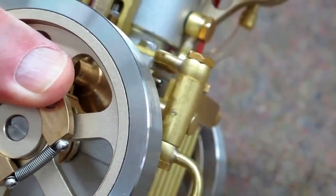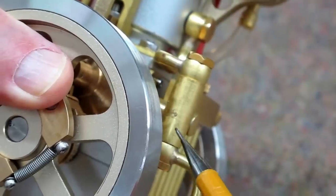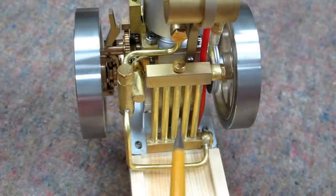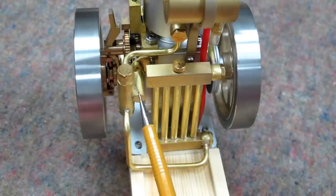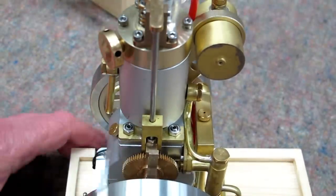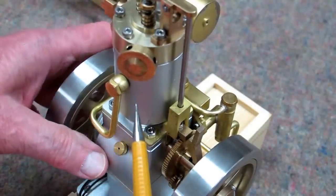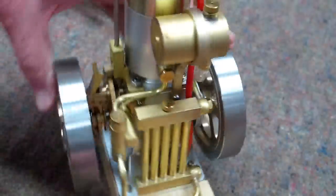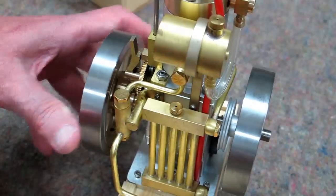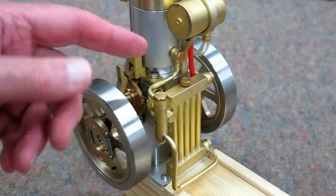There's a pin right here, so I'm guessing there is some type of check valve assembly — or a ball acting as a check valve — for this pump. It looks like the plunger pump is taking suction off the bottom of the radiator, pushing water into the lower section of the water jacket until it comes out of the upper part. That pushes the air out, then it returns to the top of the radiator, which vents and keeps it from building up pressure from heat expansion. I use distilled water in these model engines.